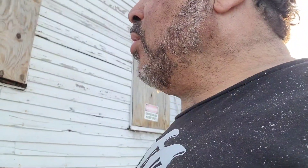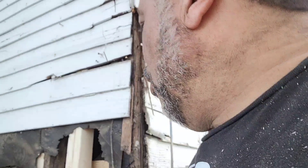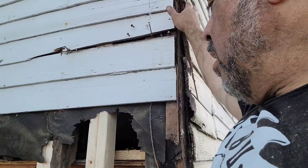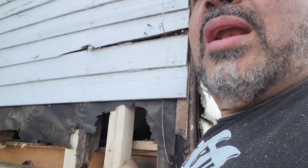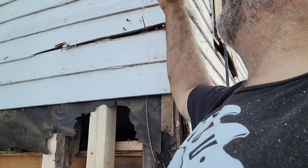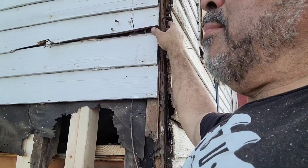We have been working out here on the red brick house. What we've had to do is rebuild the exterior portion of the house right here — this literally was rotted out where there was nothing holding it. We built up a whole framework where we jacked it up and got it up here in place.